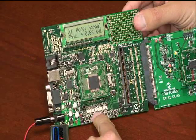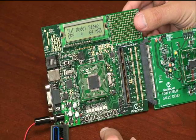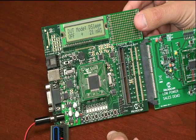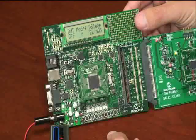As we exit run mode and enter sleep mode, you can see that the PIC consumes a mere 60 to 65 nanoamps. By pressing the next button, we enter deep sleep mode. Here you can see that the current consumed is approximately 20 nanoamps.